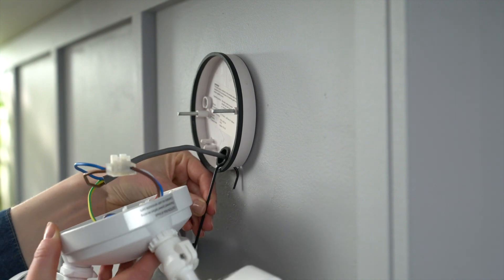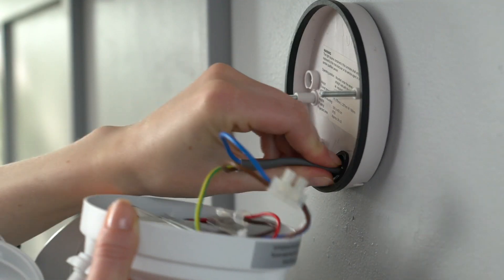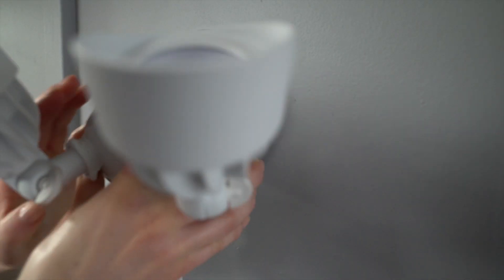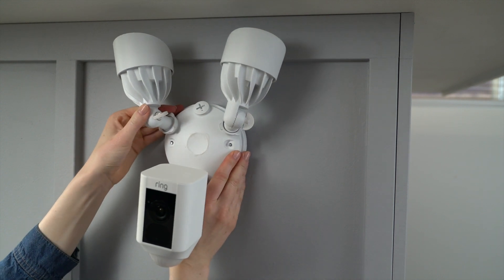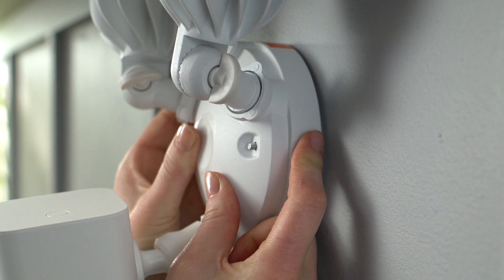After wiring, remove the floodlight cam from the hook. Fit the extra wires inside the case. Then position your floodlight cam over the mounting bracket. Line up the mounting posts with the mounting holes and press the posts through the base of your floodlight cam. Make sure your floodlight cam sits firmly against the mounting bracket.